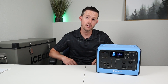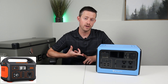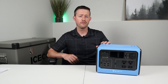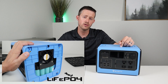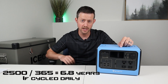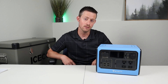Now this comes in with 537 watt hour capacity batteries. That's the same as most of the other power stations in this bracket — the Jackery 500, EcoFlow has one, GoLabs has one, Rockpals has one. That's where everything else starts to change. The first thing that's amazing about this battery is it has the built-in lithium iron phosphate chemistry, which means you can charge and discharge this battery 2,500 times and still have 80% of the capacity remaining. They basically call this a lifetime battery, and basically everything on this thing is gonna fail before the batteries lose capacity.